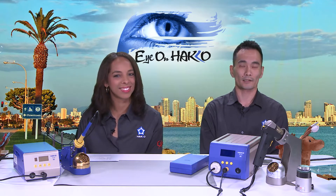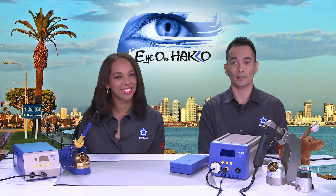Let's recap the FR-400: Ultra Heavy Duty desoldering station, 300 watts of power, temperature range 350°C to 500°C, standard safety features like auto sleep and auto shutoff, password lockout for process control, three presets, a built-in vacuum pump so there's no need to connect an outside air source, and larger-sized N60 nozzles. Once people were able to desolder those large components, the next step was needing a way to solder those components back onto the board — and that's where the FX-801 was developed.